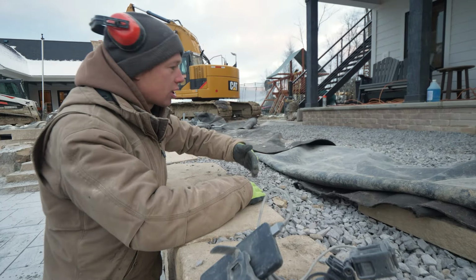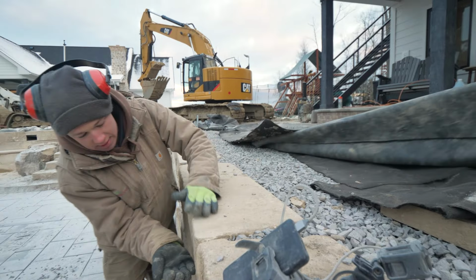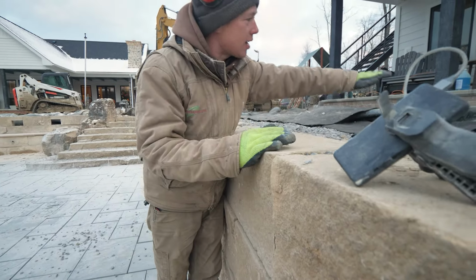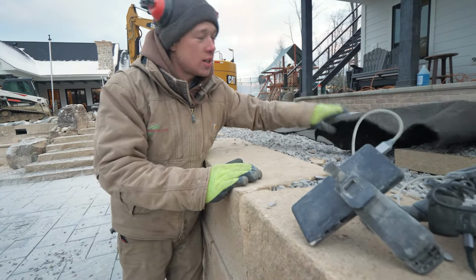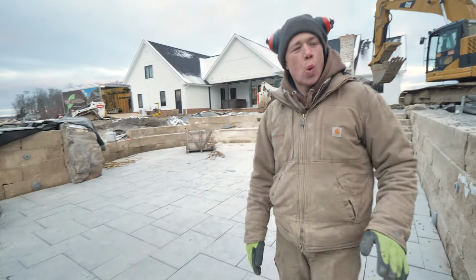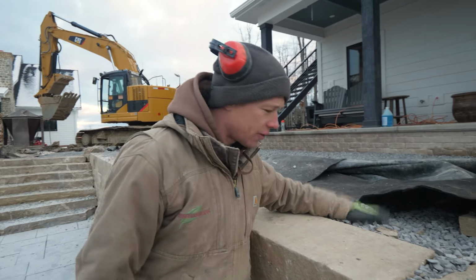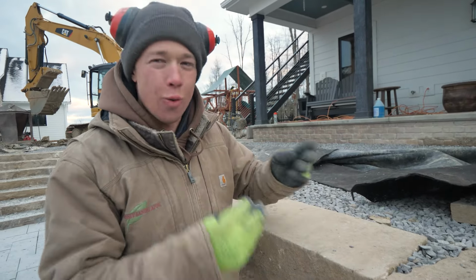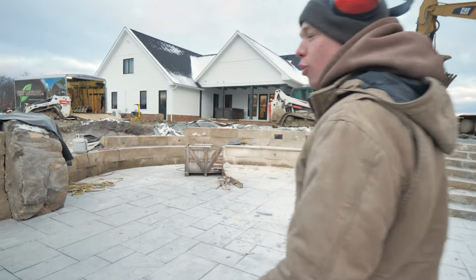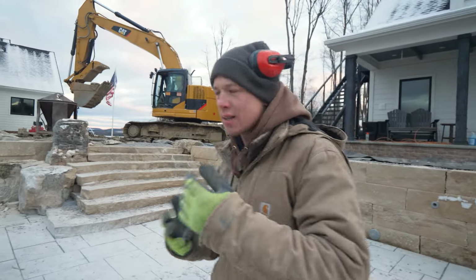This stone is actually gonna be inside the liner. That liner will flip back. Water level is gonna be down 6 inches, so water level will be about here. And then we'll just screed nines over that. That's all clean stone inside and outside of the liner, so we should be good to go. I do want to fill this thing before I do pavers, because if there's any void space in there, you fill that with water, that collapses pretty quickly. Although we were very careful, you couldn't use any heavy compaction equipment because it's inside the liner.